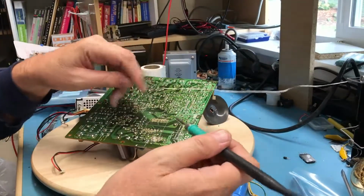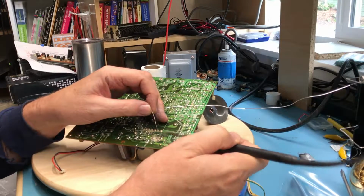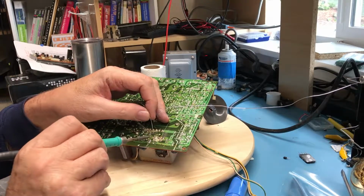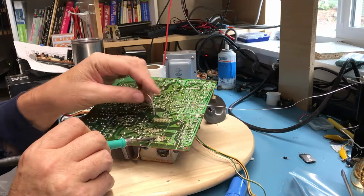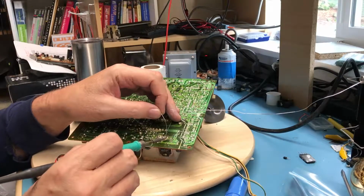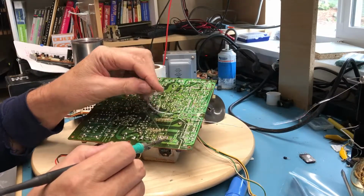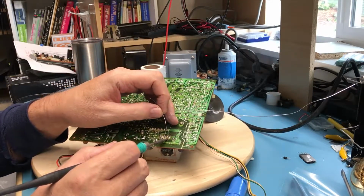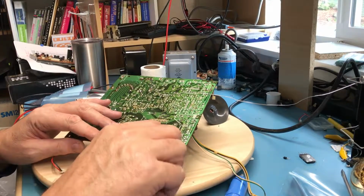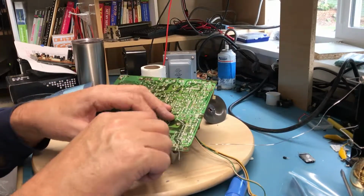Clean up very well. That wetted nice. Soldering is, of course, a mix of getting good contact to the PCB and the device lead to get heat on both. I don't like the way that pulled away. Not having so much dwell time that you lift the copper off the board, you have enough dwell time that everything gets good solder flow. It's as much art, in my opinion, as it is science.